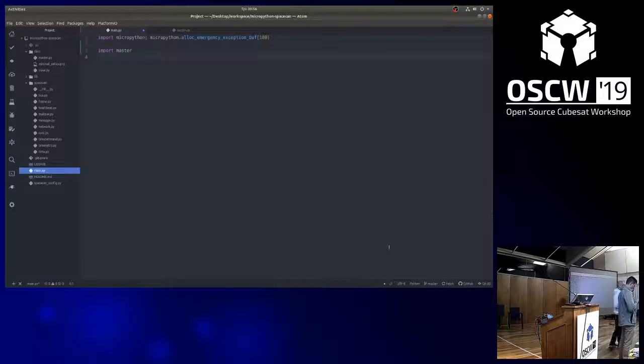In order to set up a network, in the center we have this breadboard, and on either side we have a CAN bus. So a CAN bus network looks like this. You have terminating resistors on each end because it's a differential bus. What you need to do is connect to it with your CAN transceiver.